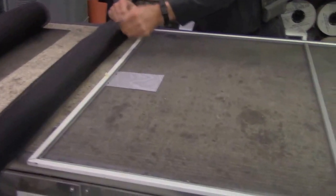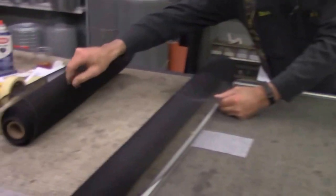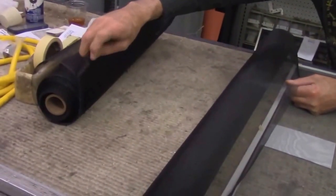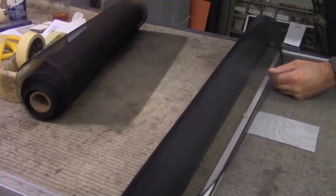When you roll them with nylon, it's a little more forgiving. There's also aluminum screening — it's rigid, bends a little stiffer, and when you roll it, it's just different. Some people think it's a little stronger, but the nylon is good for 9 out of 10 homes and it's easier for a homeowner to roll themselves.